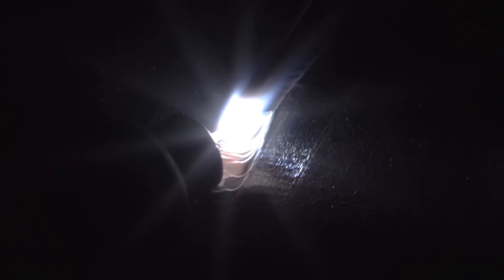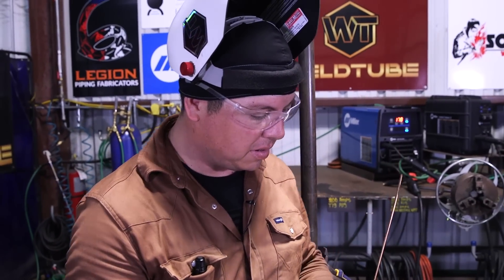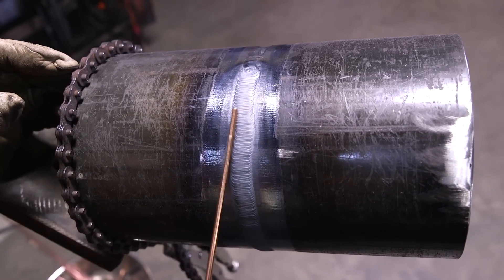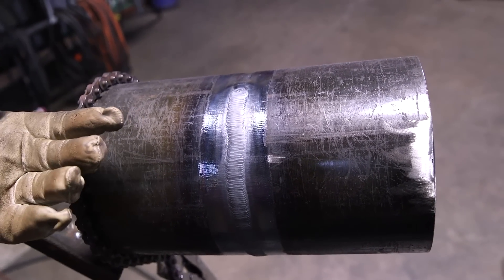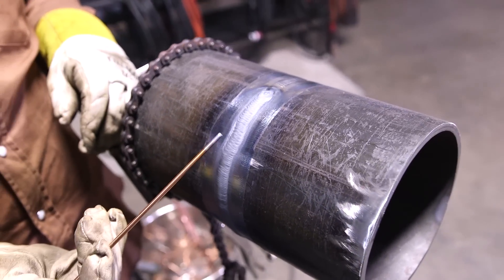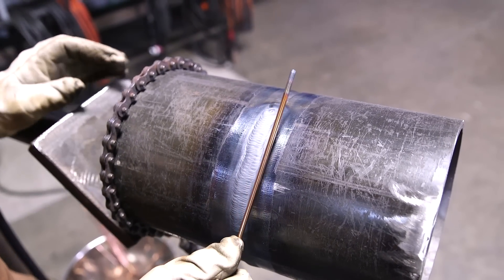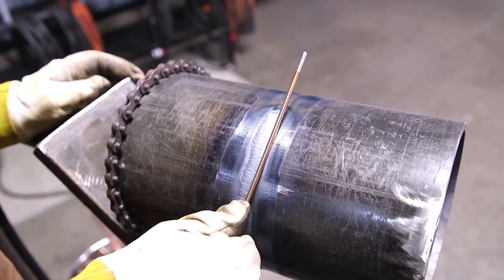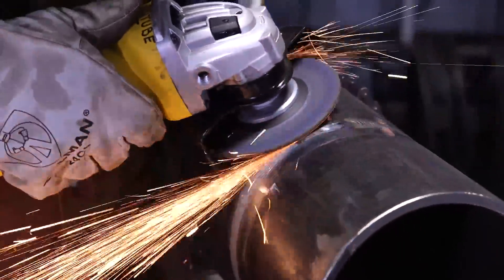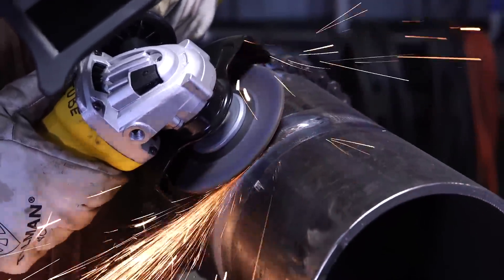This kind of stuff does happen out in the field. As you can see, on this side we didn't burn our bevel edge - it's still showing. That's visually not acceptable. What we're going to do is grind this whole section down, get a tiger disc and kind of blend this side. Grind it smooth - I don't want to remove too much metal from this side or dig down deeper than what my pipe is. Then we'll go ahead and recap.